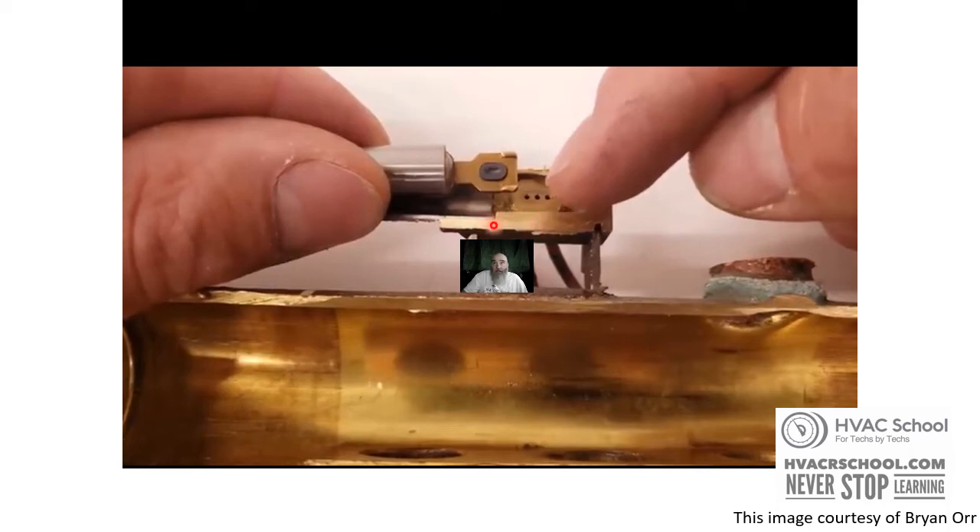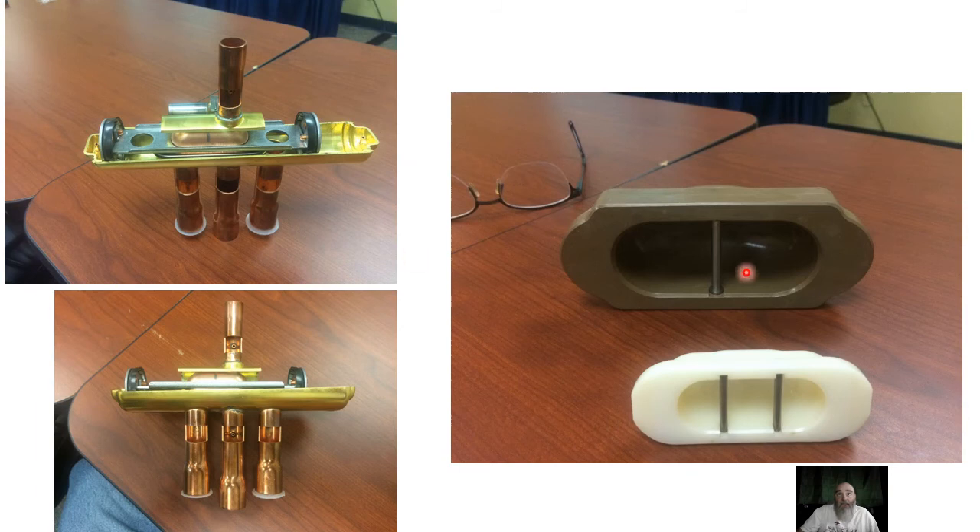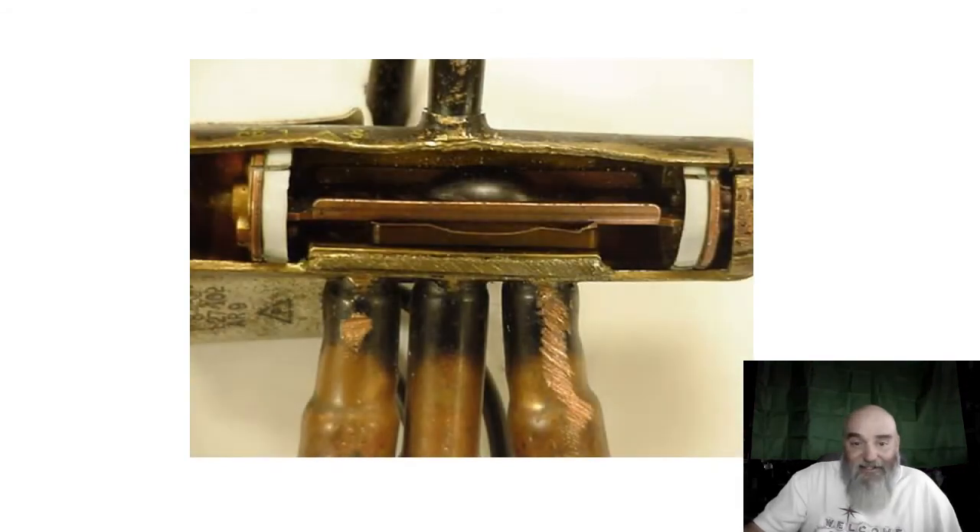That's a screen capture of a video Brian took. They're better with their cutting-stuff-in-half skills than I am. There are the little holes, there's the cup — I don't know what that's specifically called — but that's what redirects the flow from these two ports to those two, or vice versa. You can see where that same assembly appears in the earlier photograph, and where they took a saw and successfully sliced it in half. There are also some photos I took that give you real good insight into what the slide assembly looks like and where the refrigerant actually gets redirected from pipe to pipe. That one there is a good example of my own handiwork — I knew what a reversing valve looked like inside because I did this, including the delicate parts you can't overheat and why you don't smack it with a wrench.